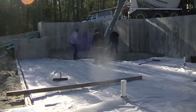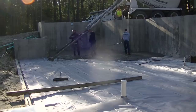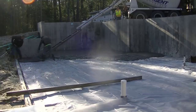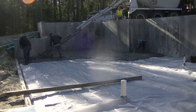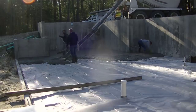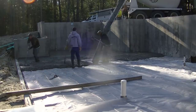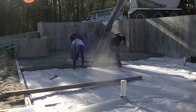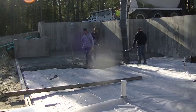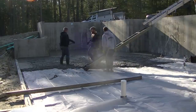I'm using a bull float to smooth out the surface of the concrete and get it ready for power troweling later on. I've got a 5-foot bull float on this one — we have multiple sizes, but today we took out the big one. Now we've got one of our extension chutes hooked on. I've got a 12-footer, a 16-footer, and an 8-footer, and we usually carry all of those every single day. We'll get as much of the first concrete truck dumped out as we can to make room for the second truck.